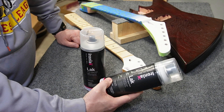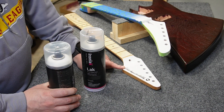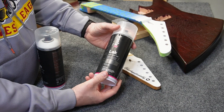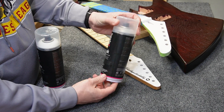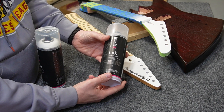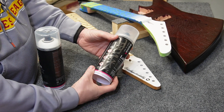I have about two coats of this on the headstock here, and I've sanded in between those coats down to about 400 grit, just to knock off high spots. This is what they call a clear varnish coat or gloss varnish, and again I think this is basically an acrylic lacquer — it sure acts like it when you lay it down. The nice thing is it also lays down fairly thick, and I haven't been able to make any runs with it yet.